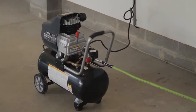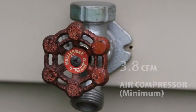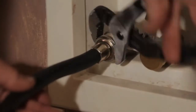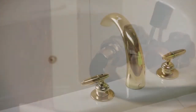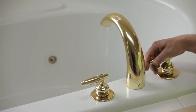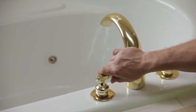All lines must be blown free of water using a minimum 3.8 CFM air compressor. Hook up the compressor to an outside hose spigot or to a laundry hookup. The compressor needs to be fully charged and all faucets and/or valves should be in the closed position. Once charged, open the faucet or valve furthest and/or highest from the compressor hookup. Each faucet or valve should be opened one at a time, and then closed prior to moving on to the next one to ensure full pressure at each fixture. You can open either the hot or cold side first, then close it before opening the other side. Continue doing this to all fixtures.